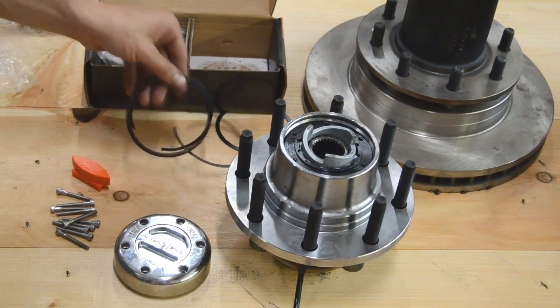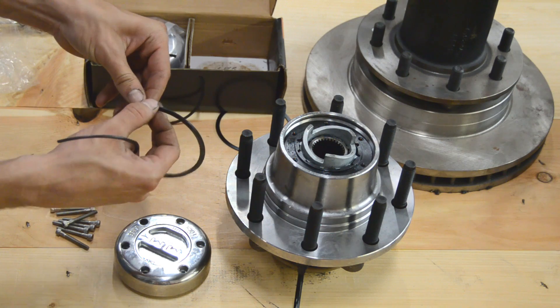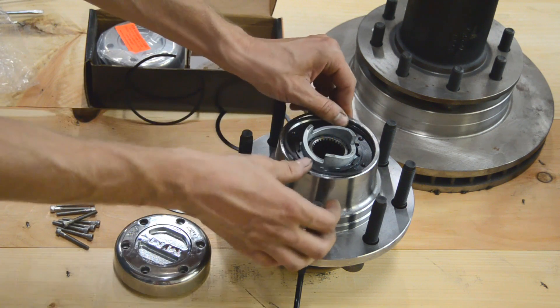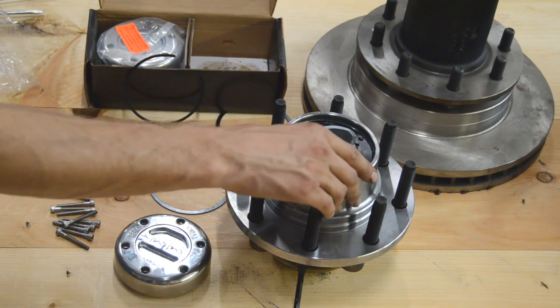You're going to take two of your snap rings. You have the C-clip and this is called Spiral Locks — this is a multi-layer clip. First you're going to want to install this; it snaps right in and should be nice and easy. Also, don't forget to clean this groove where the clips go in and clean out all the inside if it's greasy or dirty.